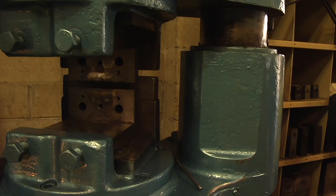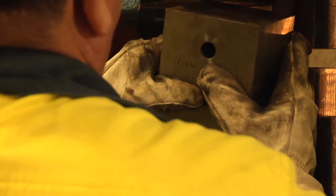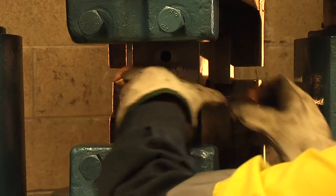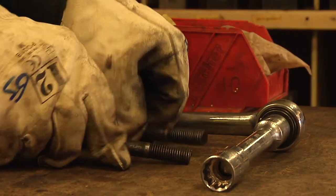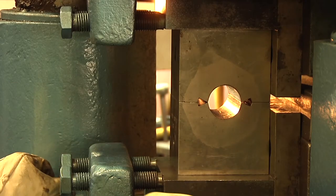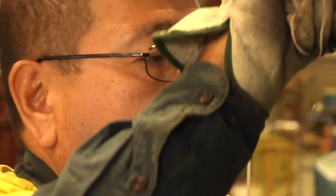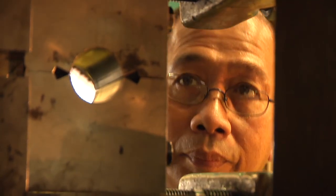On the press itself, backing plates or adapters are required for certain jobs. Make sure the appropriate plates are properly installed. When small dies are inserted, they should sit higher than the backing plate. With all dies, make sure the correct locating bolts are used to anchor them firmly into place. If necessary, use thread tape to produce a secure fit so that the die cannot move. Check the die's alignment, making sure all surfaces and edges are perfectly parallel to guarantee correct closure.